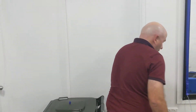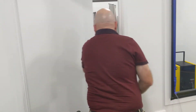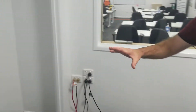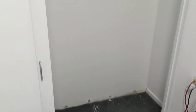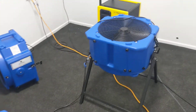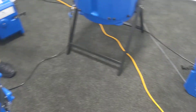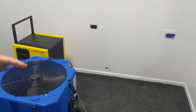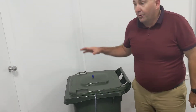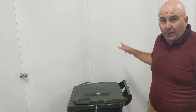How we're drying — we've changed it around a little bit. The wall in here was bone dry, the dry matting's been removed. We just put a couple of axial fans in here. We're top-down drying this floor, and I guarantee this will be bone dry and fully dry tomorrow. They're not lifting the carpet, and with not lifting the carpet we've been able to successfully dry that — it was very well extracted.